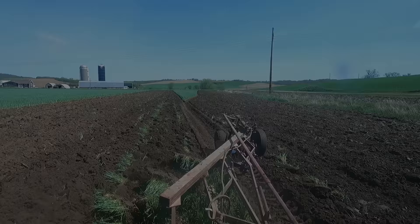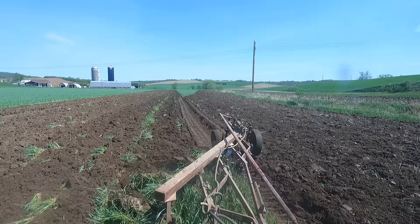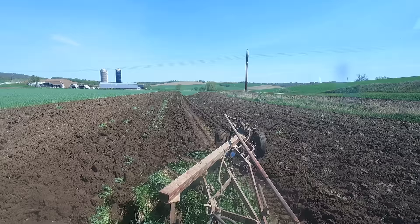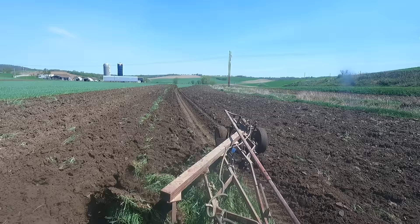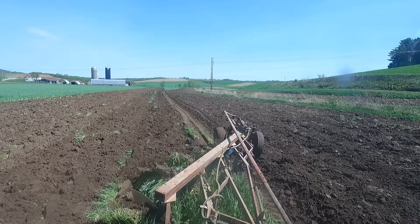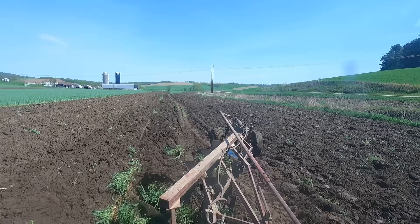This is the part where you have to be a little more careful. What I do is put the front down a little deeper and back up a little bit, so you kind of tilt the plow so your dead furrow isn't quite as obvious. I'm going to go this way and then come back and throw some of that dirt from the other side right back in here, because we don't want a hole in the field. That's kind of a downside to these one-way plows — they're cheaper and easier to pull, but it would be nice to just throw the whole field one way and then next time throw it all back the other way. It kind of evens out over time.